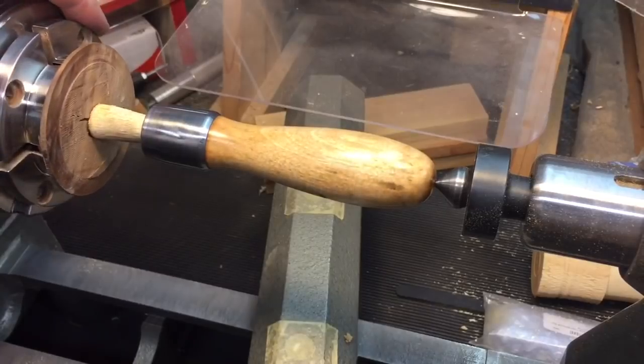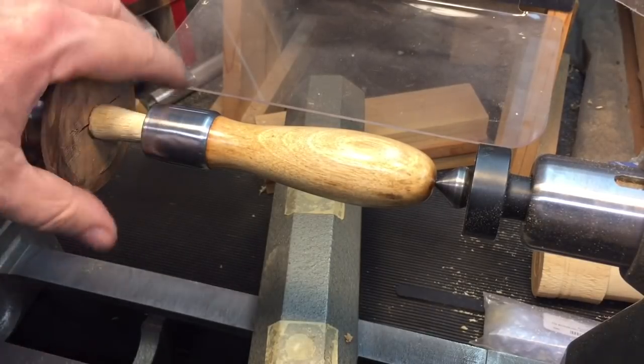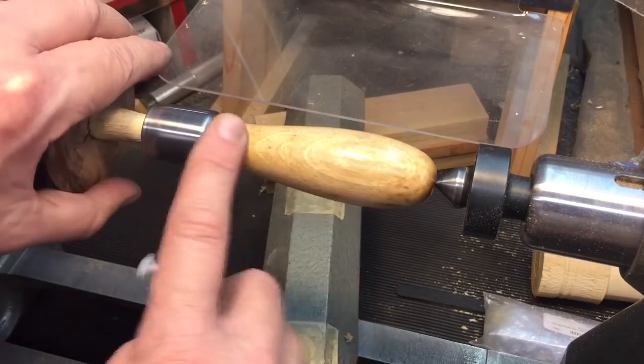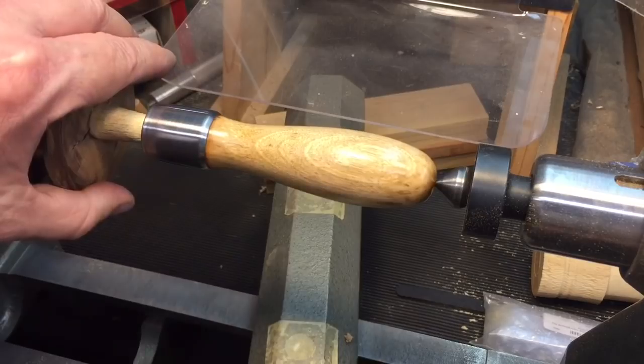See — less than 30 seconds with that Triple E Ultra Shine, and look how smooth that is — just like glass. Now we just have to put a finish on there. You could use wax or anything, but what I like to use is called friction shellac or friction polish. It's like a shellac and it'll put a nice coating on there, and then we'll be finished.